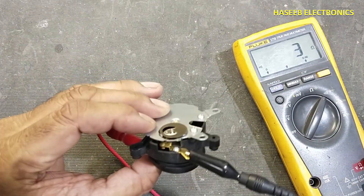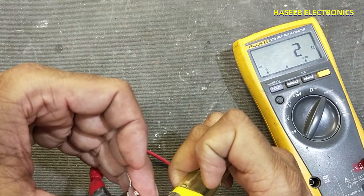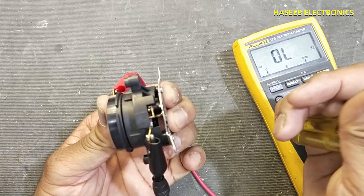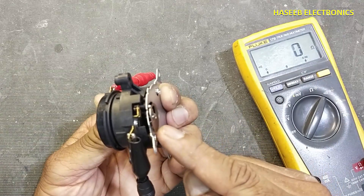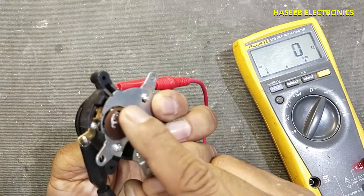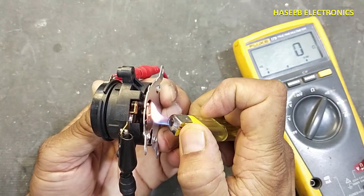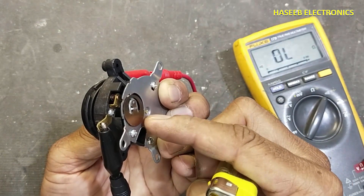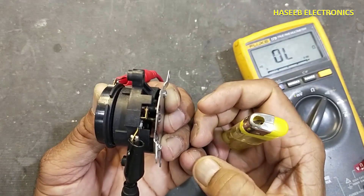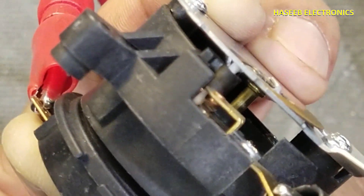For functional verification, heat up this bimetallic plate — yes, it has turned off. This is for protection: if the thermostat switch does not operate for safety, when the heating element overheats, at that time it will disconnect automatically. This bimetallic plate will return back when the temperature becomes normal. When the plate returns back, it will make this contact again — when overheated the contact is open.